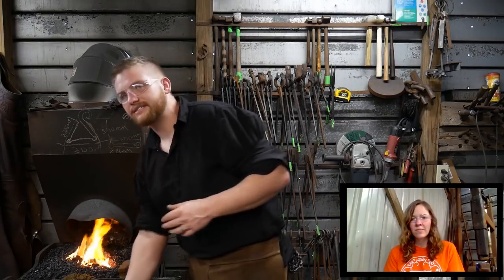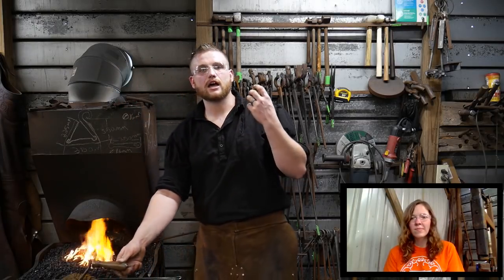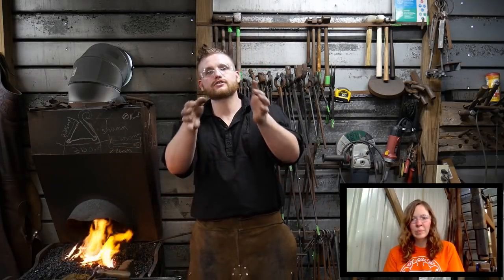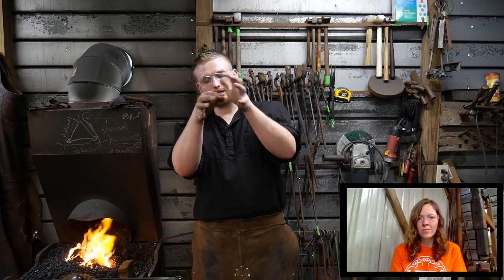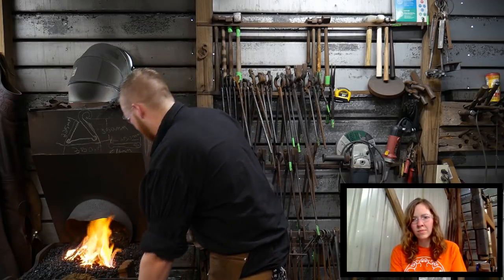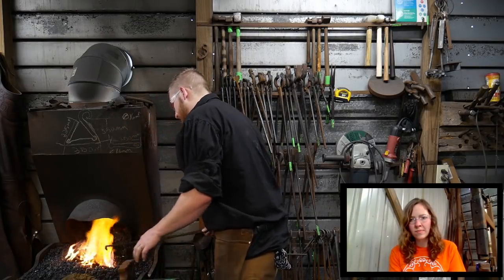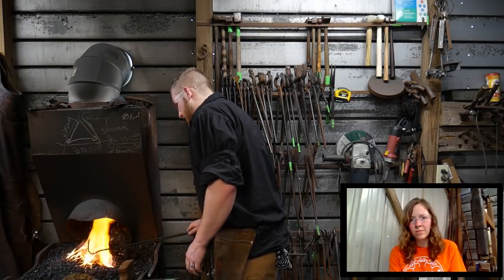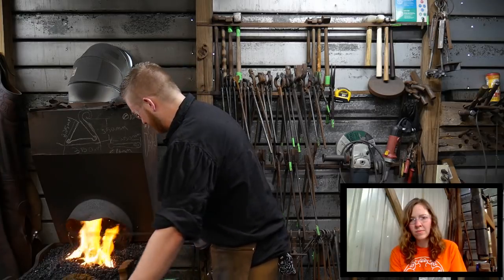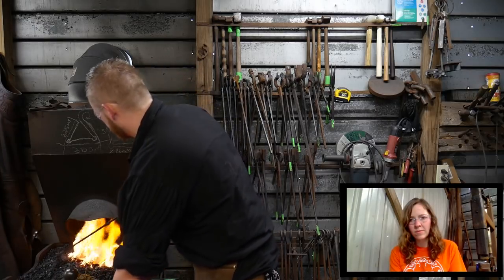The third thing that makes it difficult is that it is a collar weld. Collar welds are more difficult to obtain because there's a lot of surface area around this conical shape that you're trying to get welded in. And so that makes it even harder. This isn't the hardest weld to do, but it's definitely up there.